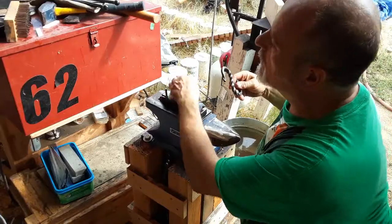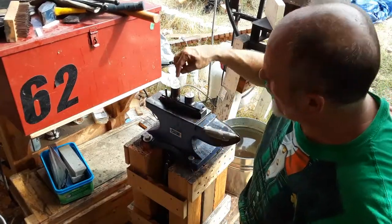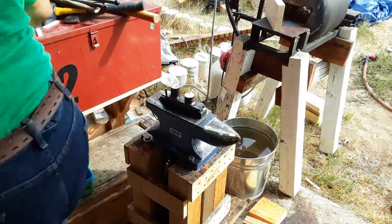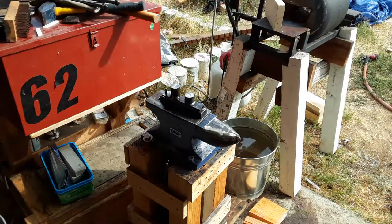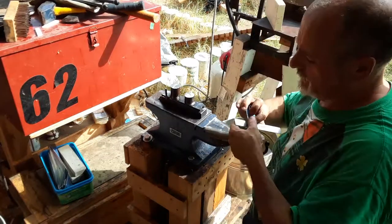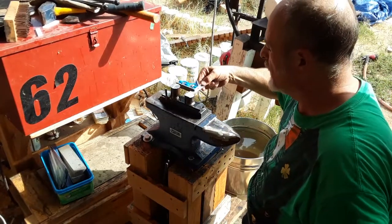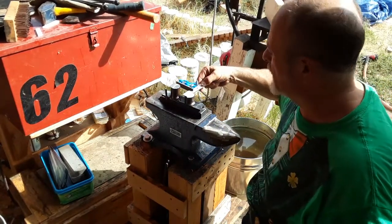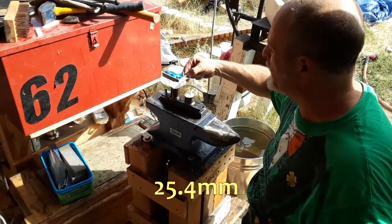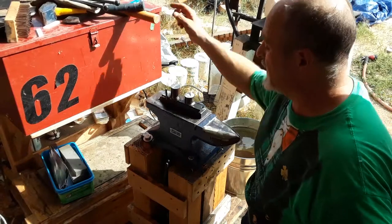These are about inch and a quarter — ow, they're still hot, I thought they'd be cooled off by now. These are exactly an inch and a quarter diameter steel rod. I honestly thought these were high carbon steel before, but when we were cutting it I noticed there was absolutely no star sparkle effect — it was all just straight and boring sparks.